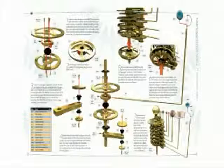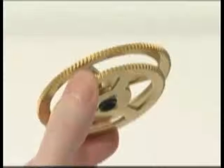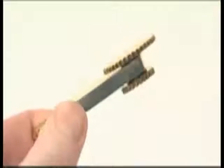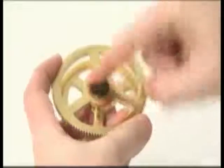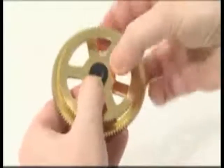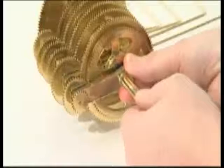The seventh phase of stage 2 adds Uranus and its moon using components supplied with issues 31 to 35. In this phase, the large gear sandwich has 106 tooth and 91 tooth gears, and the small gear sandwich has 37 tooth and 22 tooth gears. Place a plastic washer above and below the large gear sandwich on the central column. Ensure the gears mesh with those above.